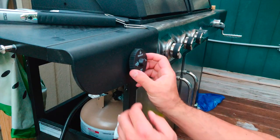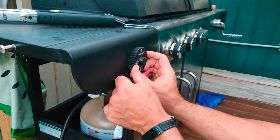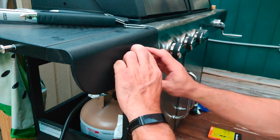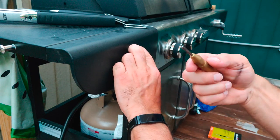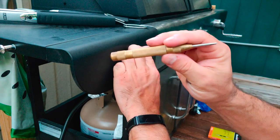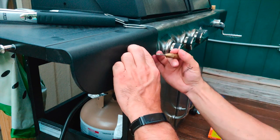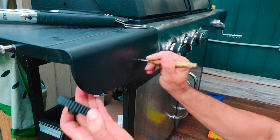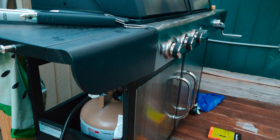I don't have anywhere in particular that I need it to go, so I'm just gonna kind of eyeball a spot, and I think that looks pretty good. So I'm going to use this center punch just to kind of mark an approximate hole for the drill bit. And these are really handy, spring-loaded center punch. I'll link one of these in the description as well. And it just makes a little dimple so the drill bit doesn't walk around on you.